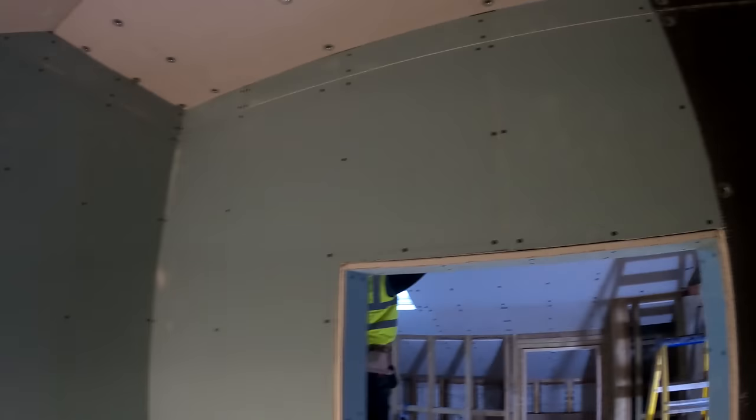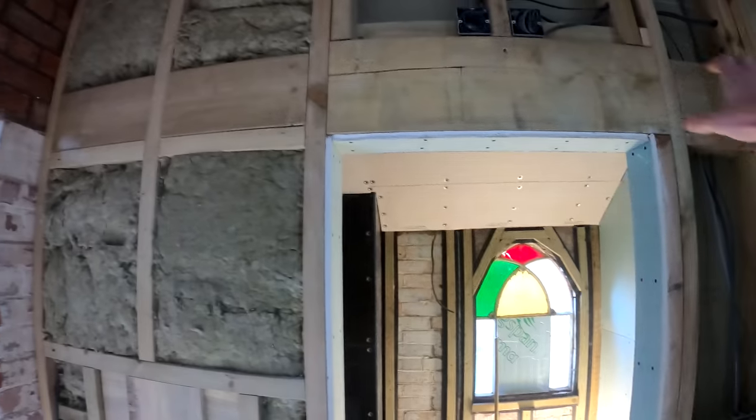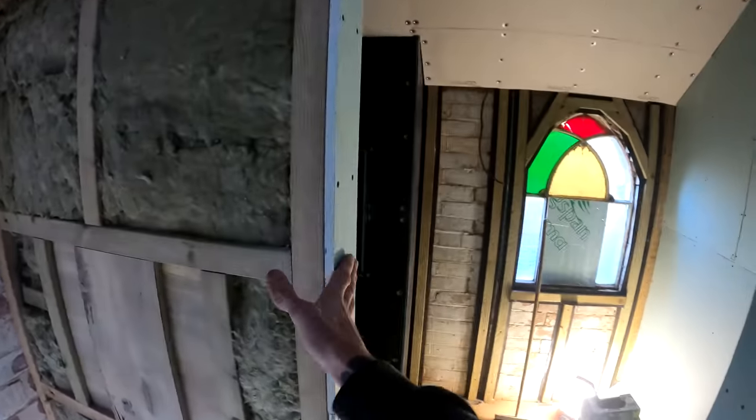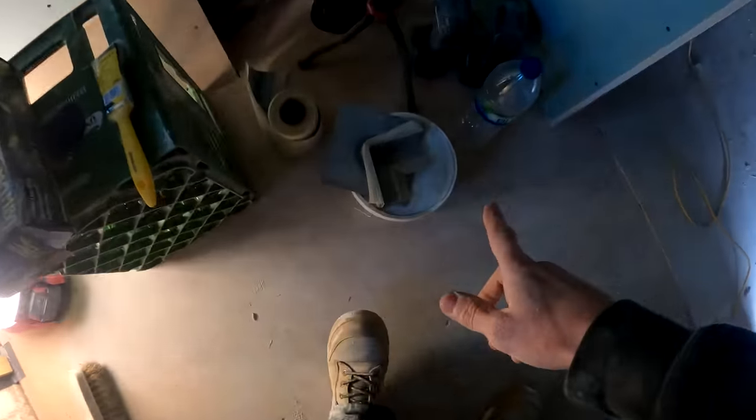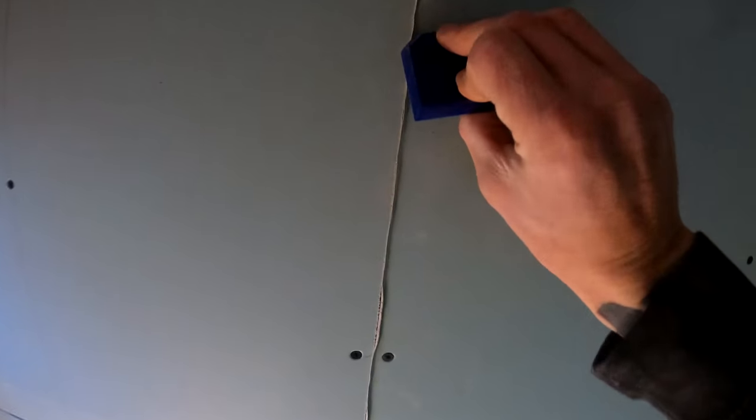So all the moisture board is on in here. You can see as well that I've boarded these reveals - this is because obviously we're having our sliding door in here, it's like a barn style door which will slide across. These need to be plastered because there's no lining going in here. So now what I'm going to do is drop onto the tanking. You've seen me use this stuff before so I won't go too much into it, but it's really good stuff, really easy. Just literally paint the glue - the Pro Seal - on, and then stick everything on. I'm going to use a squeegee as well, which is basically a silicone tool like this - you can just literally run that over the tape and that just makes sure it's nice and flat. Then you paint the seal over the top of that as well, just to make sure it's fully waterproof.